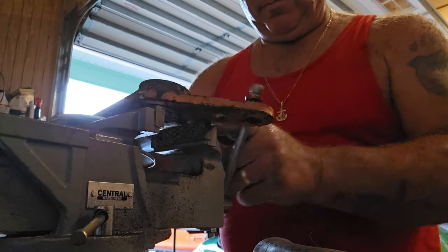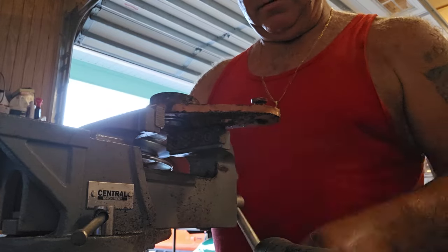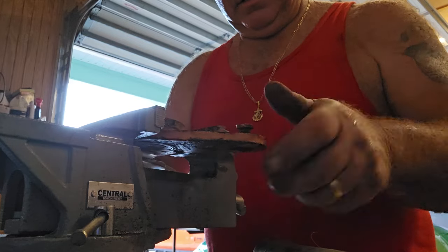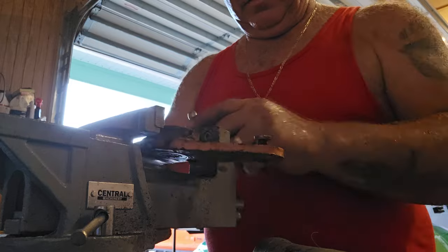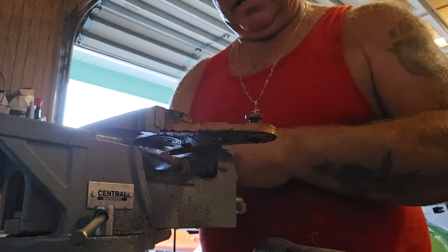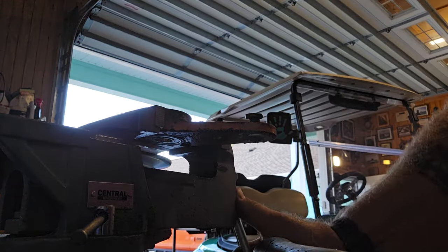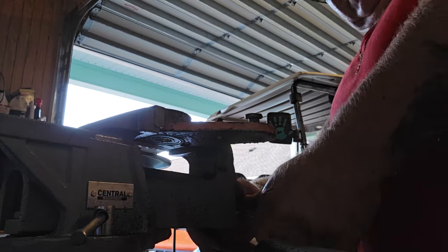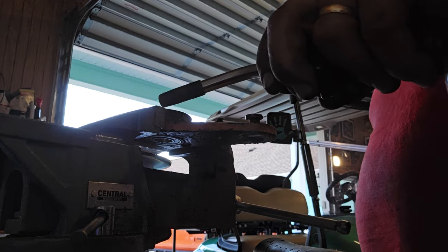The second one's fun because there's nothing to grip onto with a vice. And it's hot. I'm going to heat it up again. The other one's frozen too. It's going to be fun trying to get that second bearing off — I went through heck getting this one out. Penetrating oil, heat, penetrating oil, heat, and then I used my pulley puller as a bearing pusher. I want to heat that bearing up.